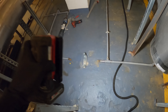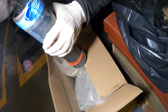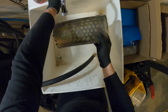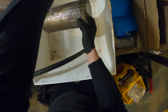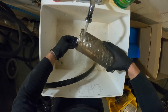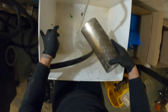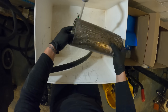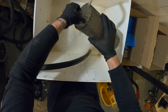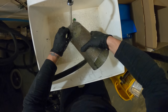While I'm doing that, Christian got the condensate neutralizer open — filling it up with some limestone chips. So as far as the strainer, you're going to want to rinse this down with some pressurized water. And when they're really bad you can use a wire brush, but honestly it's really not that bad — I don't think we need to go that excessive. Just got to get these thick things out of there. Oh wow — that's actually Teflon tape in there. What is this? I don't know. Let's rinse this off, make sure it's clean, and we're ready to go.